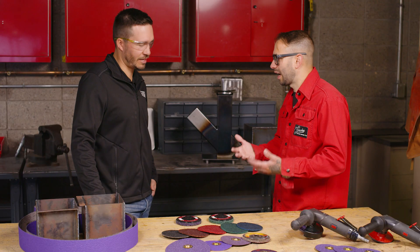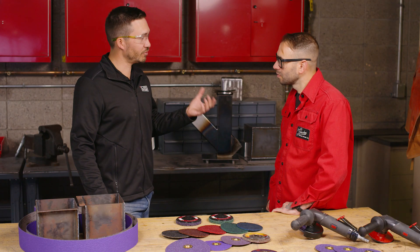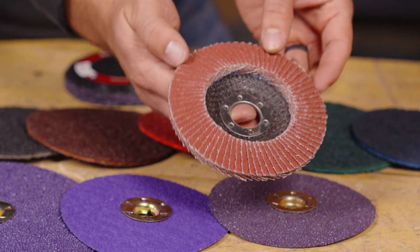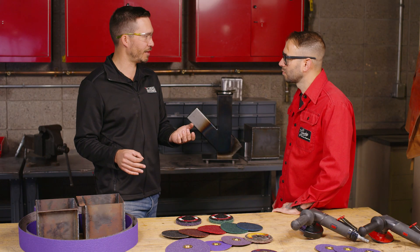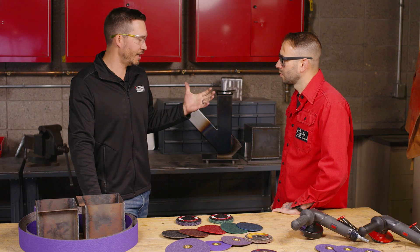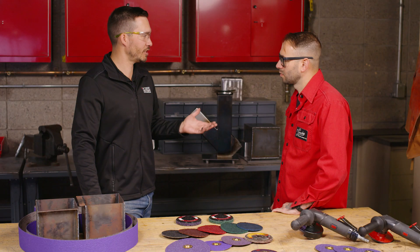So we could start with the heavy mill scale. When you get into really heavy mill scale, you need a product that'll break down and continue to cut once you're through that layer. It's like an M&M — mill scale is that thin shell on the outside of the chocolate, and we have to break through that. When it's really thick, if you're using a coated product like a flap disc or a fiber disc, the mineral is really sharp but that layer is just hard to get through, and it'll actually dull out that mineral. That's where a portable bonded product — a depressed center grinding wheel — is really tough and strong. As you use it and it wears into the metal, it will break down, which is what we want, exposing new mineral and continuing to cut down into that substrate.